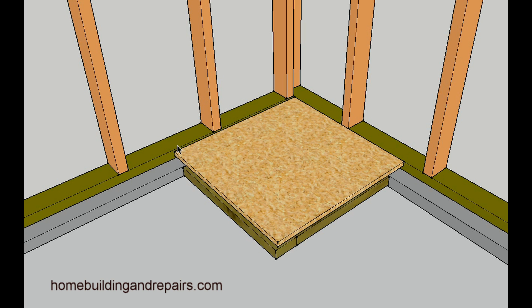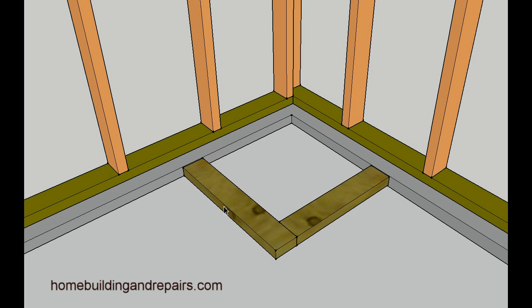Set it in the corner up tight where the landing is going to go, then get a framing square or speed square, stick it up against the corner, and mark down — or use a level — to get a couple of lines. Then you can position your bottom plates for the walls effectively and simply follow the line on the bottom.